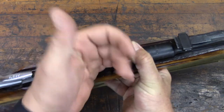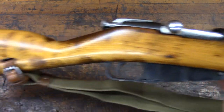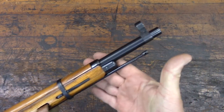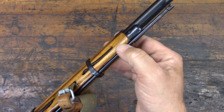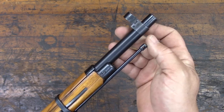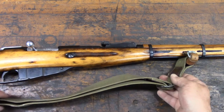Let's take a closer look at this controversial little carbine. It's still clear — nothing in the mag, nothing up the tube. I'm not going to go into excruciating detail on every tiny feature because at its core this is essentially an arsenal-refinished M91/30 rifle, albeit shortened considerably to bring it into carbine standards. Most of the work was done very nicely. You can see how the end of the stock was cut here — the barrel was turned down very nicely, the machining is nicer than on the outside of the wartime production barrel. It has a really nice crown, and I have it outfitted with a wartime production sling.